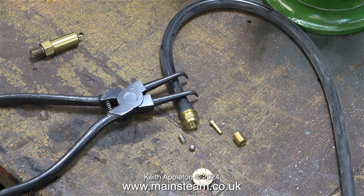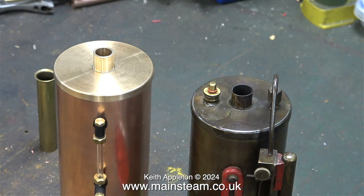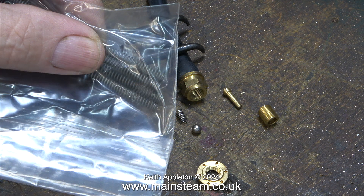I thought it would be a good idea to dismantle this valve and show you how it's put together. The safety valve on the top left is a different type, although the internal components work in exactly the same way — both will work perfectly fine. I use the express safety valve simply because it looks more like an original Bernack Vulcan safety valve. Here's a close-up of the component parts: the body of the valve, the small spring, the spring guide which presses the ball down onto the seat, and the two adjusters. These valves are made by Jubilee Fittings; I occasionally use Stuart if it's a Stuart boiler.